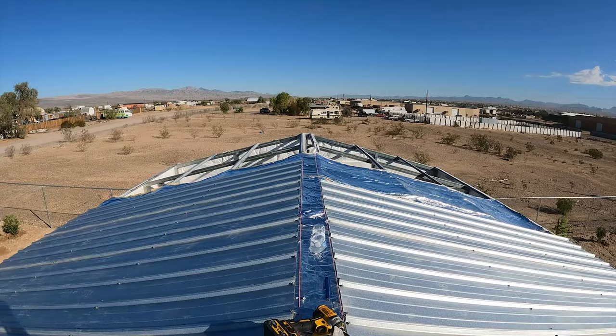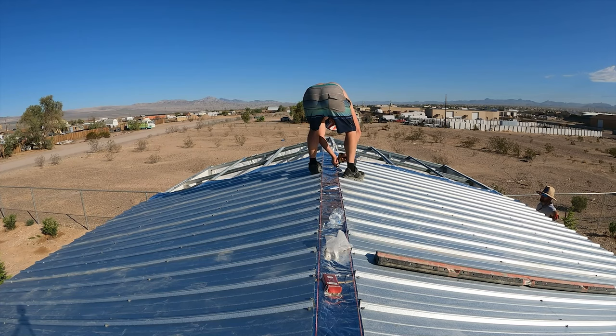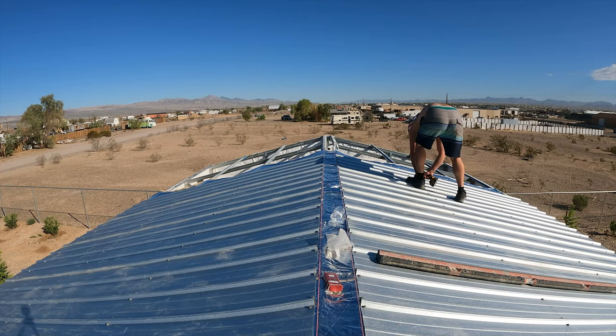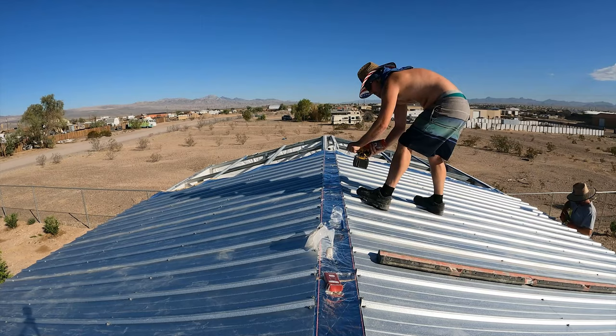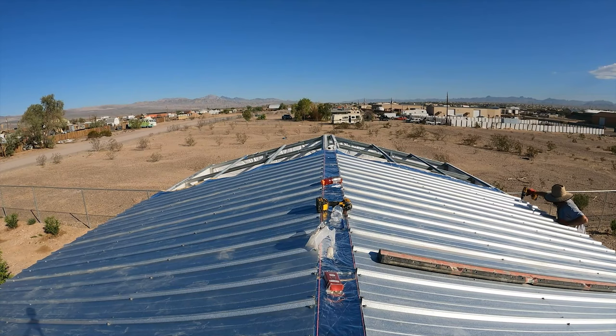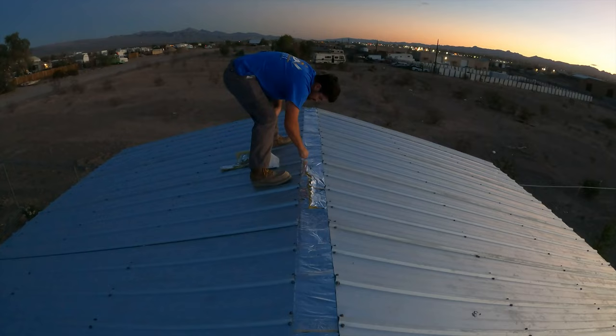You can see the insulation on top and the sheeting going on. The metal I'm using is a heavier gauge than their standard — they have three gauges you can buy: inexpensive, medium, and a super thick heavy gauge. This one is the medium gauge steel. Walking on the roof is not a problem at all — you can walk anywhere on it and it doesn't budge. You don't even have to walk at the joists because of the gauge of the steel.